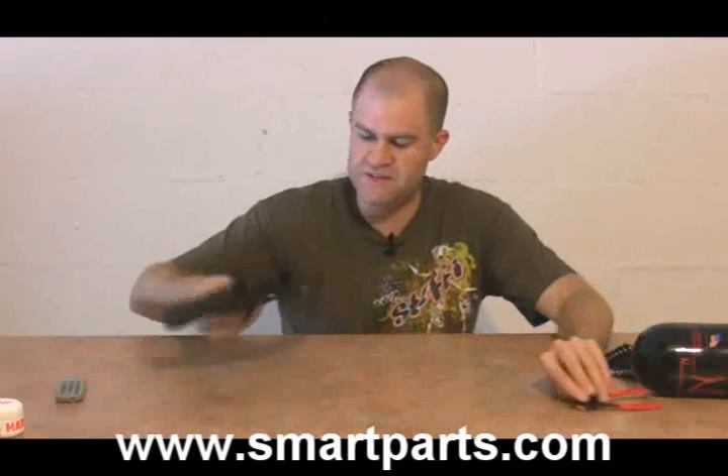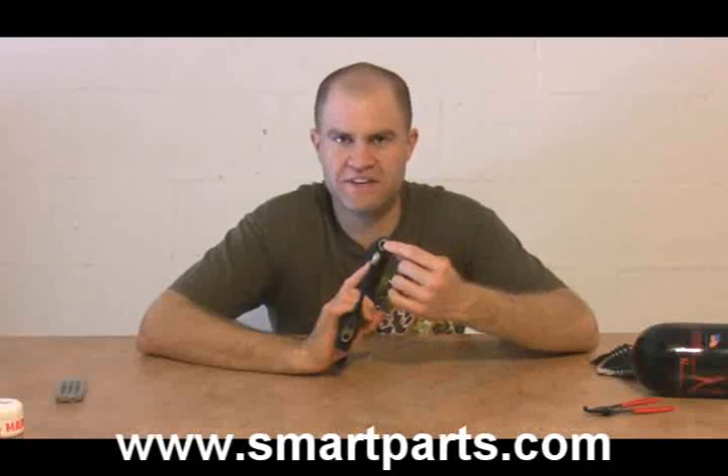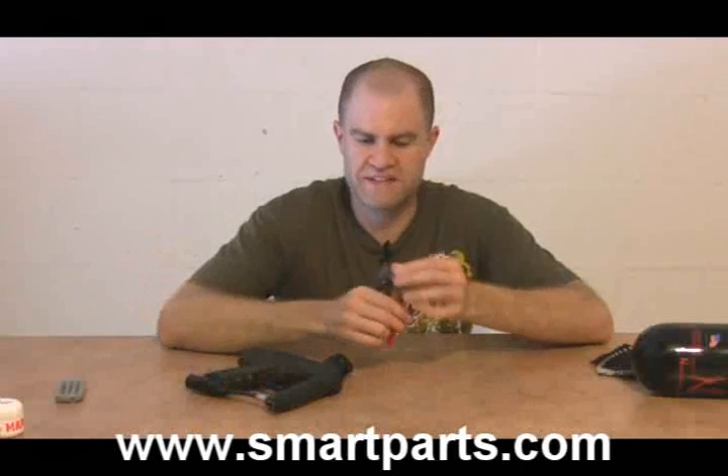The reason why is there's a snap ring at the bottom of the regulator. If you notice, if you try to take your smallest Allen key — the .050 — and try to stick it in there, it still doesn't fit. So you have to get yourself a pair of .038 snap ring pliers.